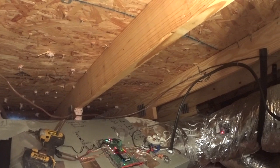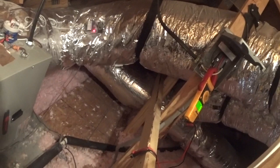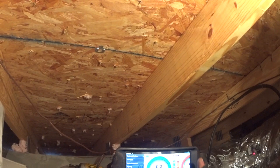I don't have the blower data on this air handler — no paperwork. Static is low and we're probably moving air pretty decent. We're going to submit that to user inputs and then start playing with the dampers.